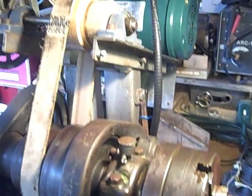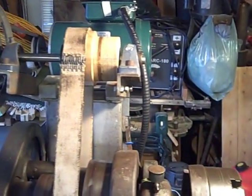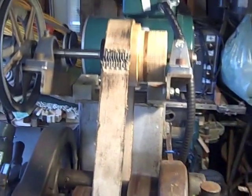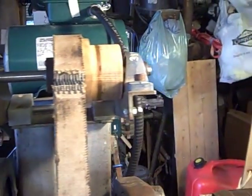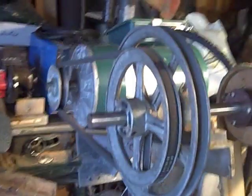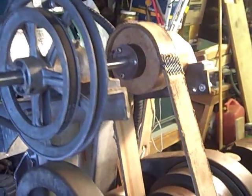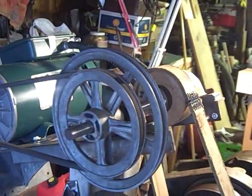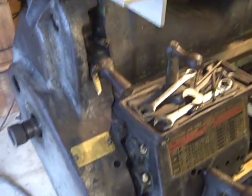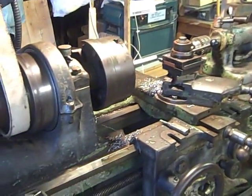Here's the temporary feed mechanism — it's wobbly, there's no question, it's far too flimsy, but it's all I had at the moment. It's a 5/8 shaft with just two steps — a two-step flat belt pulley driving the machine — and then a three-phase 220-volt motor driving using V-belts. It's all using stuff I had just to see that the thing would work and how well it would work, and it seems to be okay.